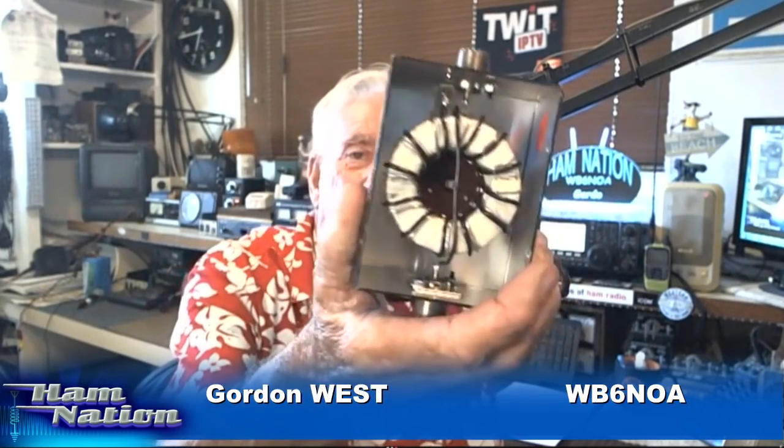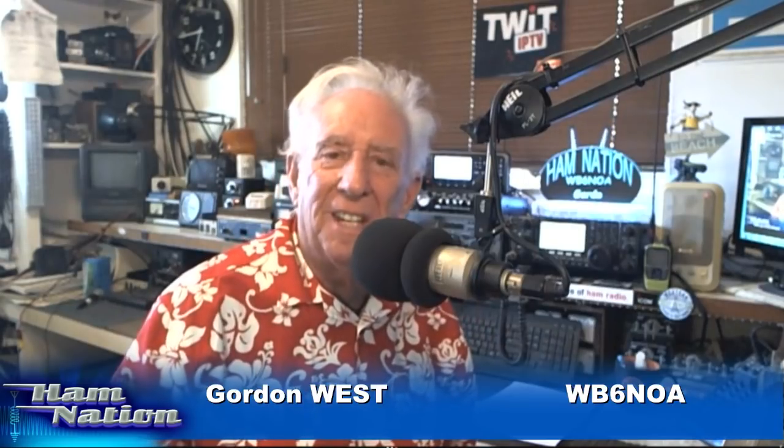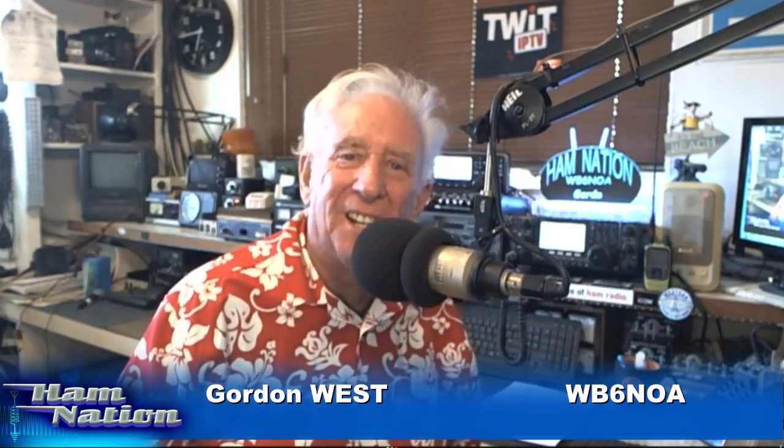This is certainly the smaller coil, but it has a very nice impedance match, though sometimes it needs a little bit of help with the impedance matchers. In the old days, the Swan radios had the same type of matching device that you'd put in series, and that way you'd get the most of the energy coming out of the antenna, and that's known as mobile antenna efficiency. So that's the very latest on antennas.